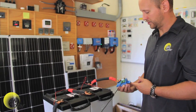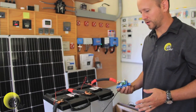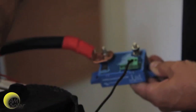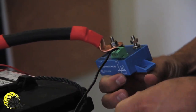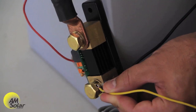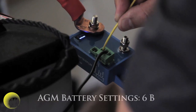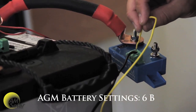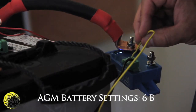In this demonstration I'm missing a couple parts like the DC fuse block, and sometimes we add a breaker, but I'm going to show you how to program your system. The first step is to remove the jumper, then using a segment of wire — just any kind of wire — I connect one end to the negative side of the shunt to get a negative connection, then tap right here on the programming port to make a connection. Once I make that connection it starts cycling through numbers and letters, and I make the connection again.